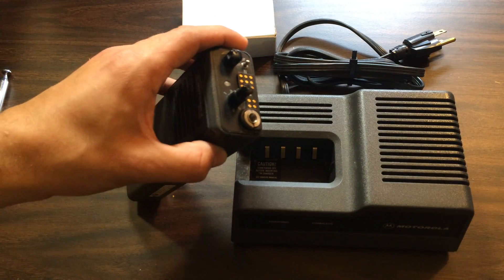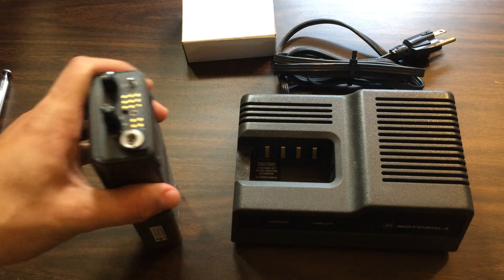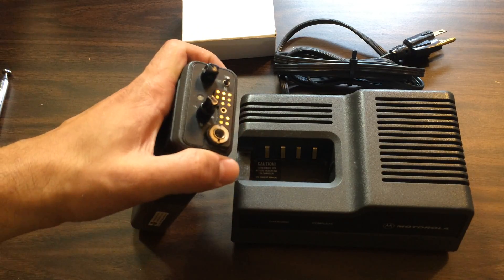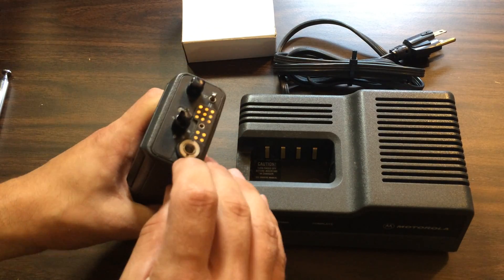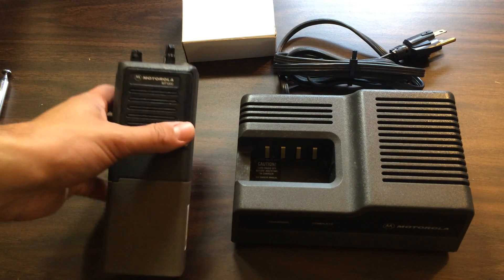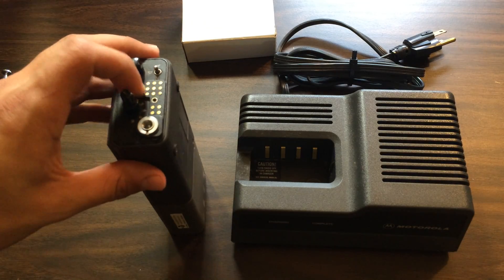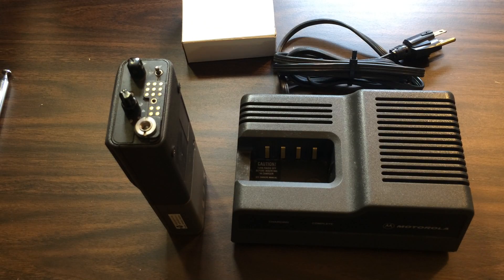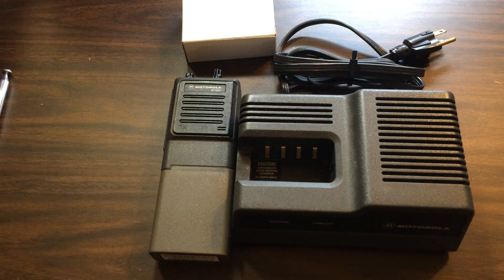It has this kind of uncommon connector. You might be able to see there's no ground lead on that connector — it's all the hot lead — so that kind of limits your antenna choice. You can get an adapter that connects to this connector that'll give you an SO239, but it's kind of bulky and not the easiest thing to find, and I didn't bother getting it — couldn't find one right away on eBay anyway.